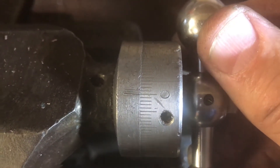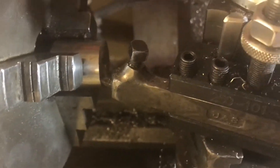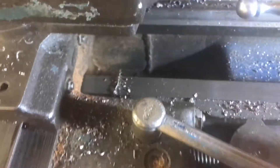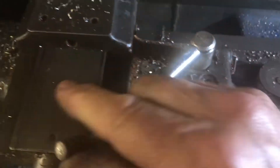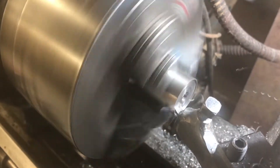I'm going to use the reference mark as near as I can, and then move the whole bed up until it's touching the work right on the other edge. Then we'll take this clamp and tighten up the apron so it can't move. I think some of that was a bit difficult to follow, so I'm going to explain again how this works.